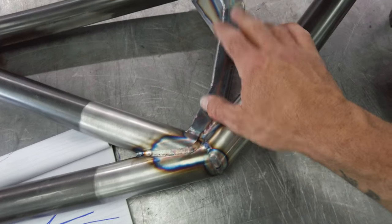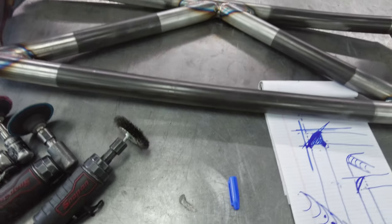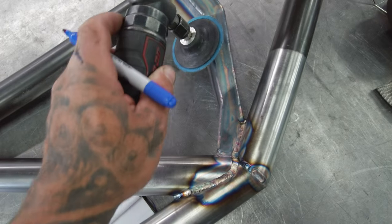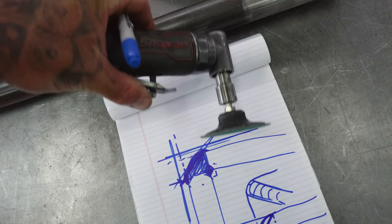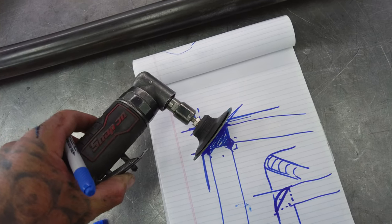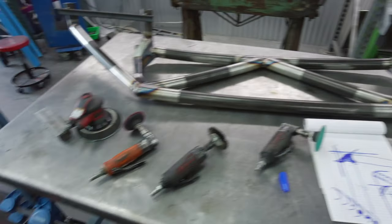So right now, I want to start with getting the plate work as prepped as I can. The first step is taking the 3-inch 60 grit and facing any of the top or vertical surfaces that I need, and then going in and making a 45, right? And that's the same with this. So face the vertical or the top without going into the actual material, just removing any of the excess weld. Then just give a nice diagonal sand, like a bevel. And that really gives you the highest chance for non-contaminated cover passes.